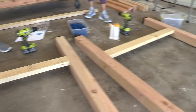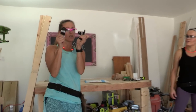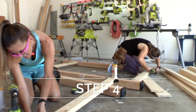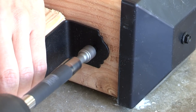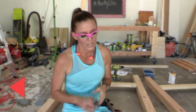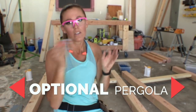Make sure they're flush with the inside of those 4x4s and the pocket hole space inside. Now we've got the bottom pieces attached and we're going to attach the top pieces. We don't want pocket holes up there because we're going to use our decorative angle brackets. We're attaching these 2 inches from the top and centering them on the inside of those 4x4s with wood screws and angle brackets. The reason we're leaving 2 inches from the top is because I'm adding an optional pergola top — it'll give you space to add those slots across the top.